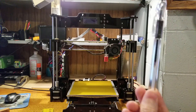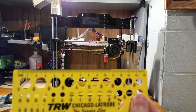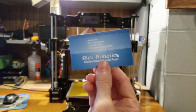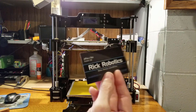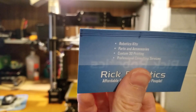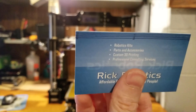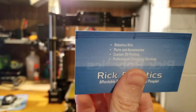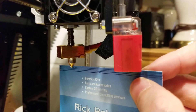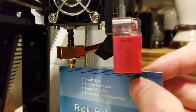First thing we're going to need is a level, a pen, a ruler — preferably something with millimeters. We'll need a business card or something similar, and then draw out one millimeter lines on the top of the card. Ideally we want about a three millimeter difference between the nozzle and the bottom of the sensor.